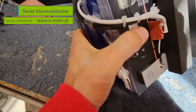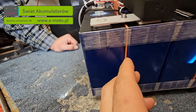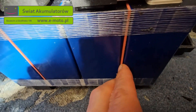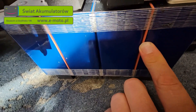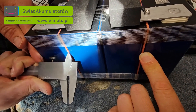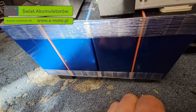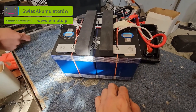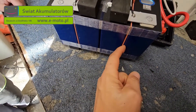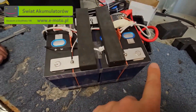Take a look at how this manufacturer has solved the heating mats. You can see there is a thicker mat placed between cell number one and cell number two — this is not just a flimsy cover, it's a solid piece, done very thoroughly. There is also something between cell number three and four. Vadim is measuring — he brought a caliper. It came out to about two millimeters. When we have a temperature below zero and this battery wants to charge, the current will first flow to those mats. Only when these mats heat the cells to a temperature above five degrees will the current be able to flow to charge the individual cells.